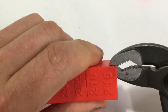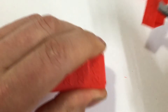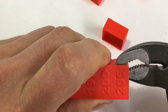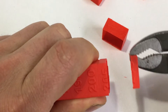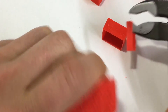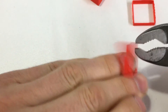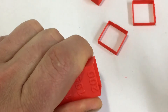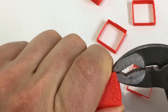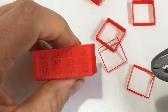Down here the layer adhesion is actually quite poor — you can see it's just coming apart right there between 205 and 210. Give it a yank — 205, 210, yeah, still coming apart pretty good. Now at 205 it's starting to stick pretty well; I actually have to pull a little bit before it comes apart. You want to remember how much force you're putting on it. At 200 it's still coming apart, but you can see you have to pull pretty hard.